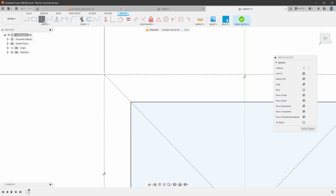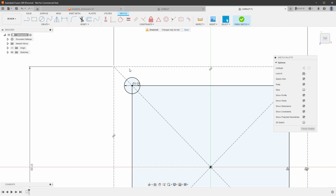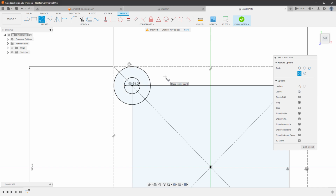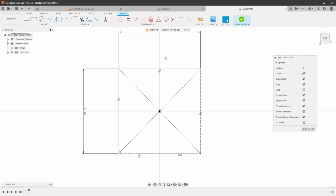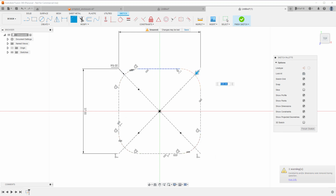So here on this position, we have a hole with a diameter of 3 millimeters, and we want the outer radius to match this hole. If I draw a second hole, I can see that if I touch this outer edge, it's 7 millimeters. So if you want to get this exact round corner, the radius will be 3.5 millimeters, which is of course the distance of the hole from the edge. So let's undo all those steps, and we can apply the rounded corners by clicking this fillet button, then selecting those individual lines and typing the value of 3.5 millimeters.